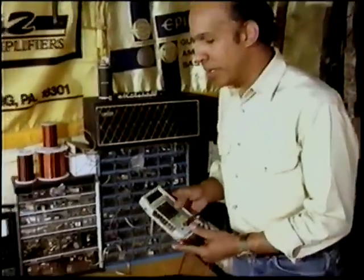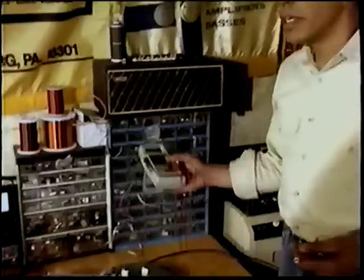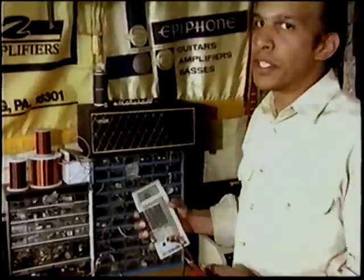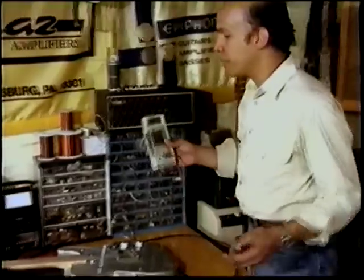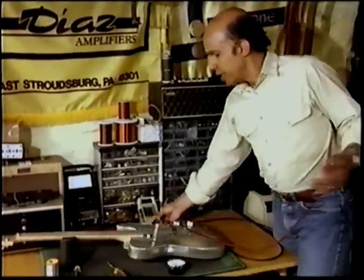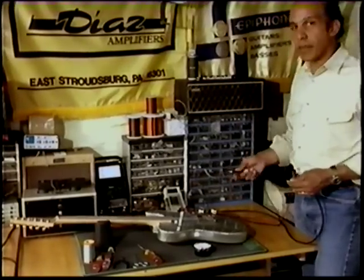It's your volt ohm meter. There are many like it, but this one is mine. Most meters have 3.5 digit scales. This one happens to have 4.5 digit. I really highly recommend this Fluke. We will use it to measure resistance, which basically a pickup is a resistor.